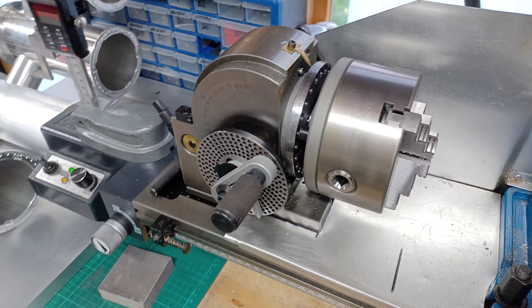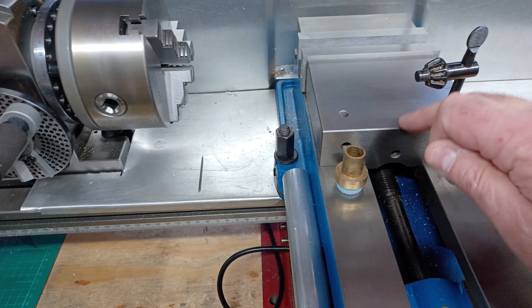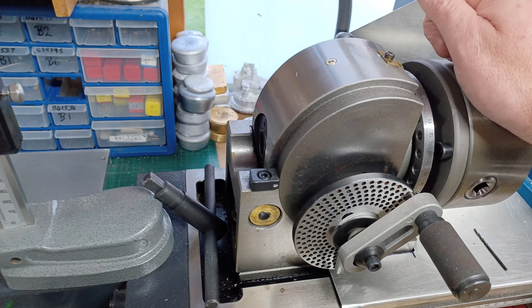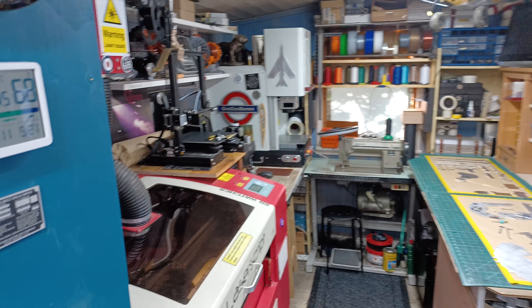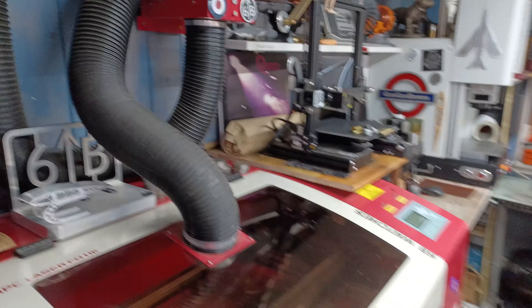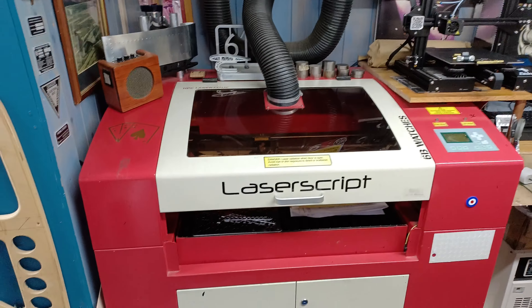The Sieg milling machine — I've been enjoying using it. I've put some splash or swarf trays on there, as you can see, and that helps massively with tidy-up. If I ever need to remove them, they're only on small magnets, so it keeps the T-slots reasonably clean. Same with the back — that's just on magnets so I can take it off should I need to. This is a brilliant little mod if you've got a big vice like this — put some sort of flywheel on there so you can open and close the jaws much quicker between smaller and larger parts.